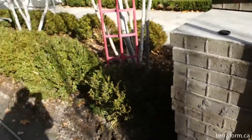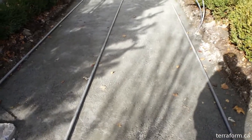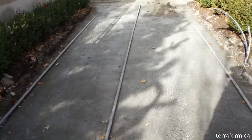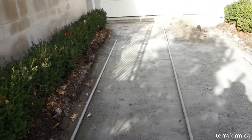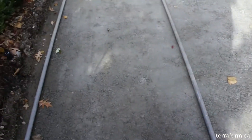We're rocking because down here the fines were getting all pumped out of the base and they were all loose. If you look at that, that's part one of this — so this is part two. We've dug out the base 12 inches and we've installed this material here.